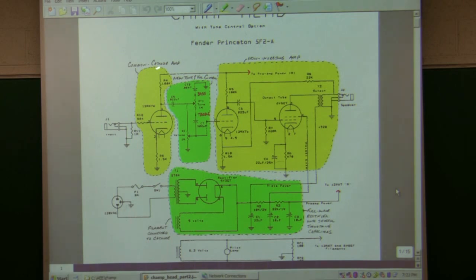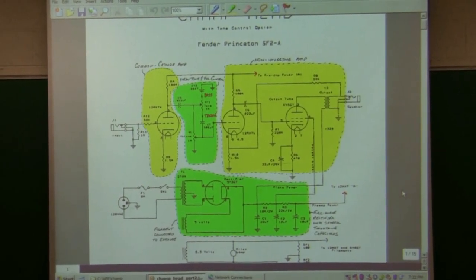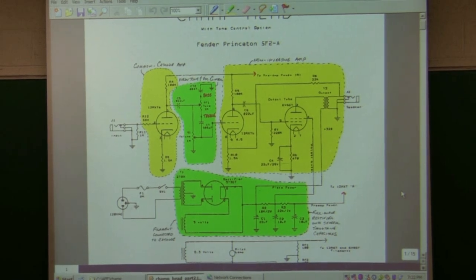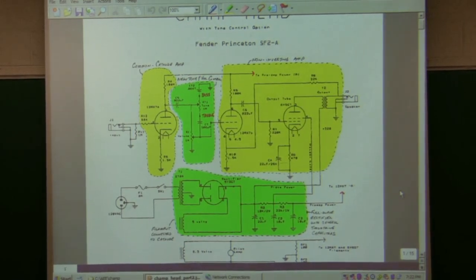And of course, this will be our tone control and volume control. They're doing just one knob to do both. I think they're just trying to save money when they did the original design. It's easier just to do two separate ones. So it's kind of clever how they played with the R's and C's in there to get bass and treble sound with different positionings of the knob and the volume knob. So it's the two together that give you the same sound effect. Same is true on the Tweed, it did the same thing.